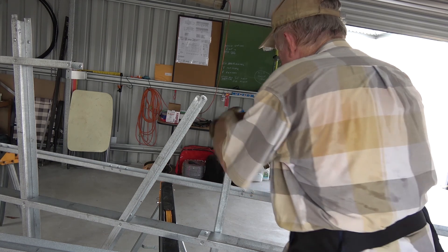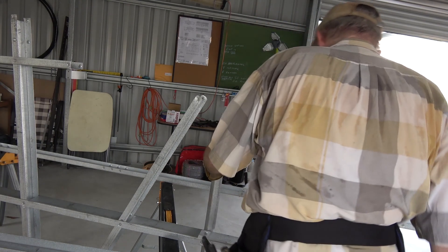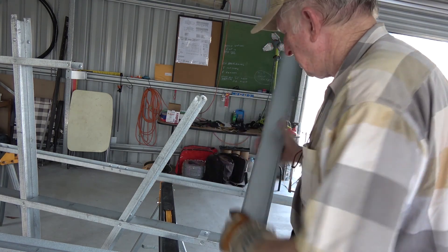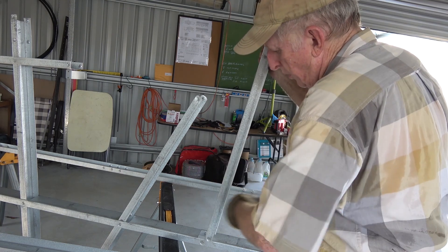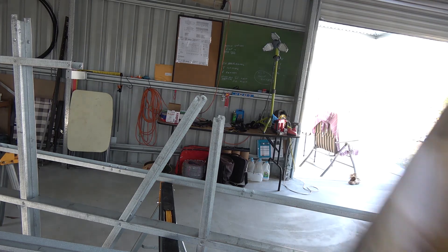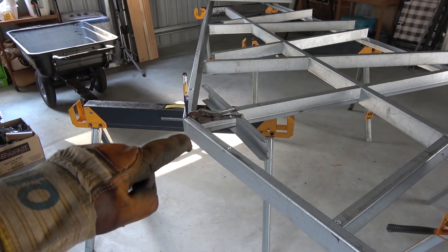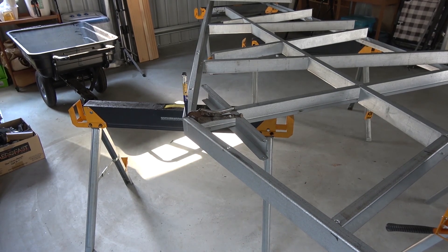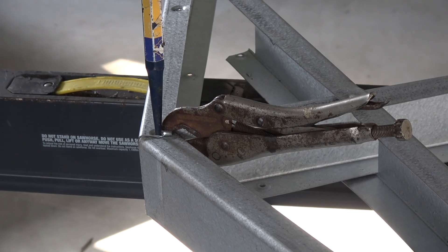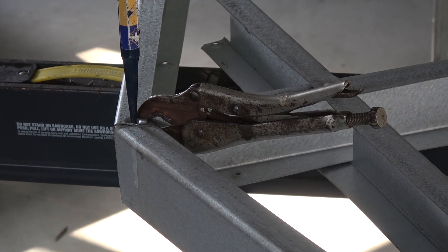Don't need to snip off the bottom ones because they're straight up and down. So we'll just snip those two corners off, give them a tap on the end, and facing to the outside we just slide those straight up. Now the next thing I do is get the peaks together — this one here and this one here — and bring this one into there. I use a podgy bar, a little sharp podgy bar and a pair of pliers, and I just clip them all together, jam the podgy bar in until it lines up. And that's it. Then I put a screw into it.